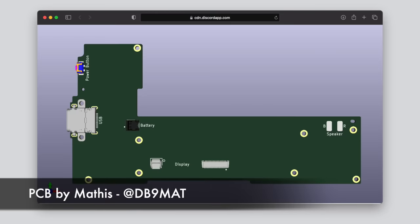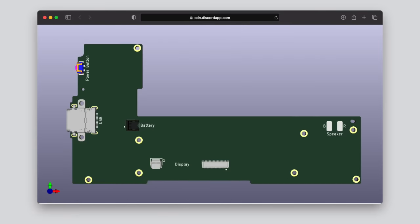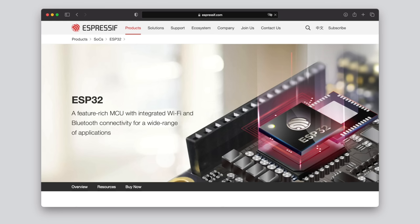There's also a project that aims to build a custom motherboard for the Game & Watch with an FPGA instead of a microcontroller. This would be pretty awesome as it would allow cycle-exact emulation of processors, and would also otherwise be great for experimentation. Others are planning to build a PCB with an ESP32 on it, which would give you a fast processor with WiFi and Bluetooth capabilities.